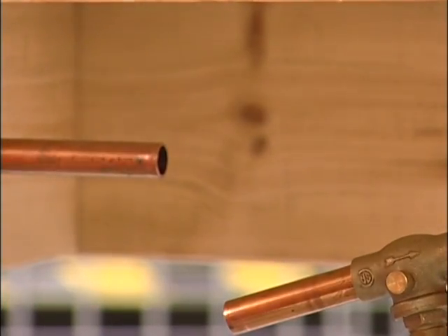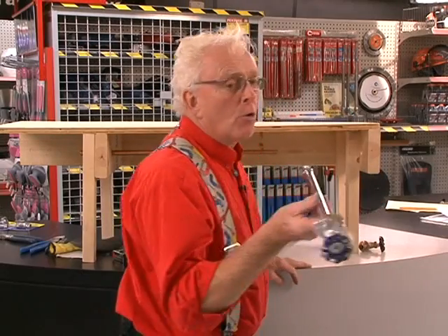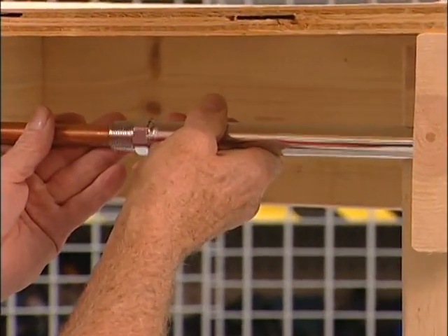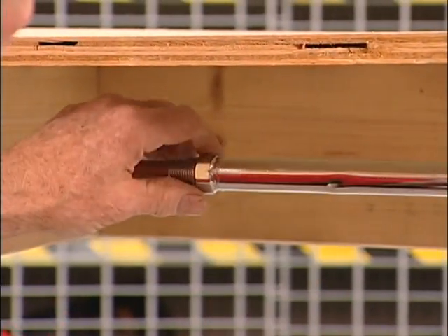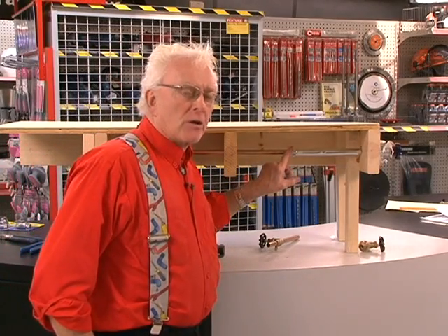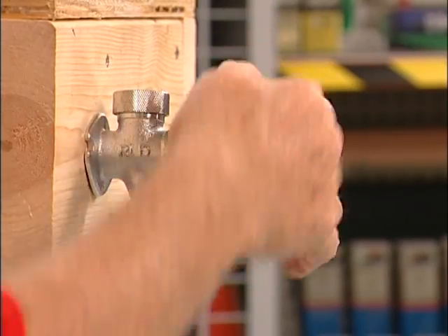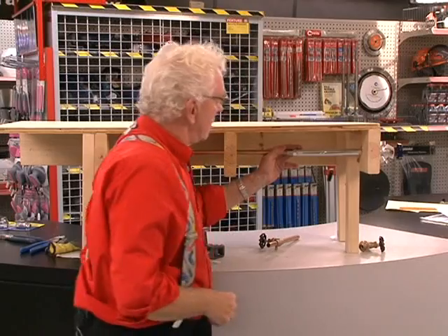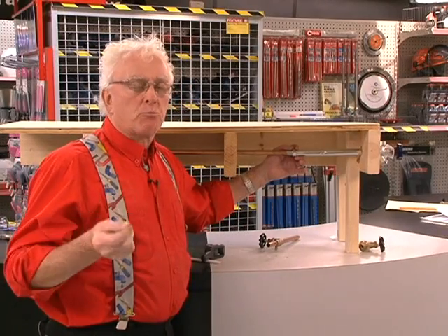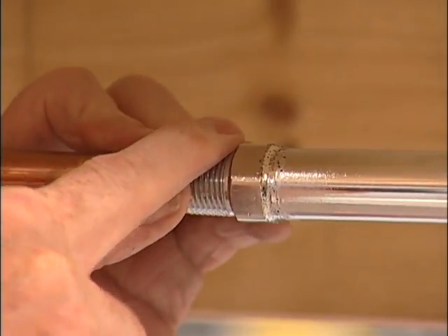The pipe is cut. What you do is unsolder the tap out front, disconnect it, then install the new one through the outside hole, coming in and lining up with your pipe on the inside. When you go to solder this joint, make sure your tap is open all the way — you don't want the washer at the seat while soldering, because it will ruin the washer, make it brittle and hard, and it'll never work properly.